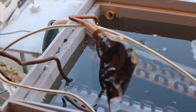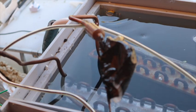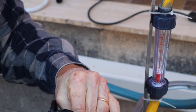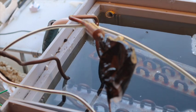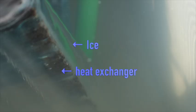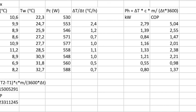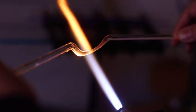I learned that it is not so easy to have a stable water level in the water boxes with sufficient water flow for good heat exchange, but it must not overflow. You must have the confidence to go to bed or go shopping without the worry of water damage. Gravity or just a closed circuit are the most secure solutions. Ice on the evaporator is a problem because the heat pump will not be able to take heat from an isolated heat exchanger — ice is to a certain extent an insulator because it will block the water flow through the evaporator. There are many variables that influence the efficiency of the whole system. The best is to start with a reasonable setup that works; from there you can improve. Trial and error is the good company of many developers.